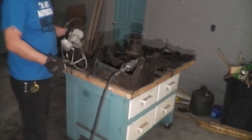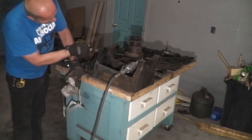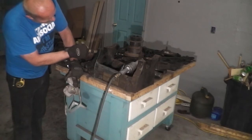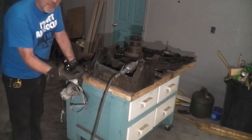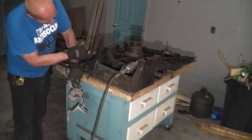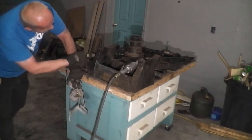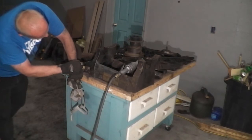Okay, in case you weren't catching in the video what this actually is, this is telling you the pin on the first row. Second row is telling you which gear. I have all of those gears, they're drive gears. It tells you which gear to get. The last one is threads per inch, and it goes everything from 32 up to 2. That's pretty cool.